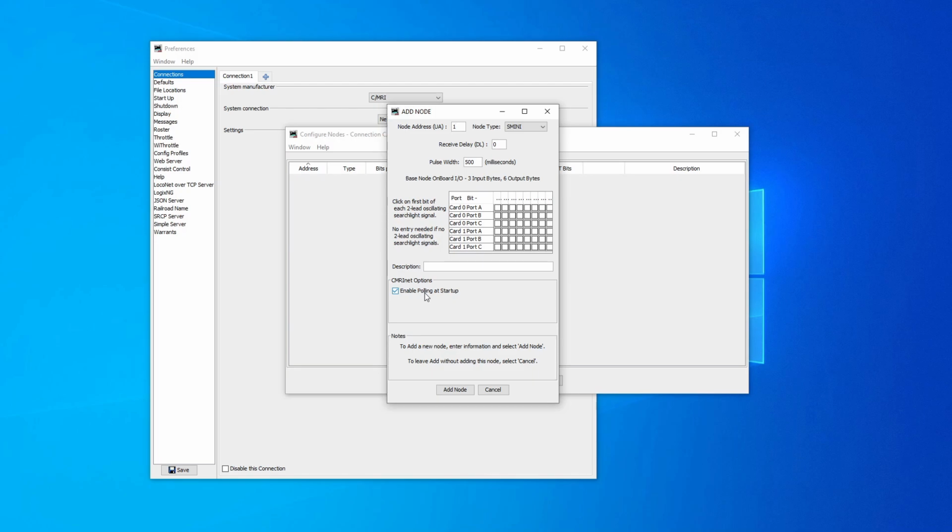However, removing polling would shift the responsibility of managing the state of sensors to the nodes. So at the minute, you can be a bit ignorant when polling's there. You can just say, right, I know that 4 times a second JMRI is going to ask this Arduino for the state of its sensors. So all I need to do is make sure that the array that's managed by CMRI, that's updated in code by doing the CMRI.setBit or setByte commands, is kept up to date. I know that that's just going to be sent 4 times a second, so I don't need to know what the current state of a sensor is, or what it used to be. As long as I keep that array up to date, then the state of sensors is going to get back.